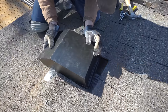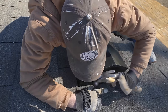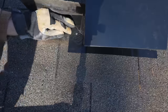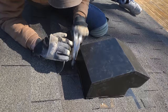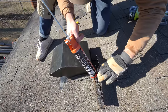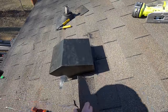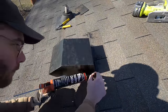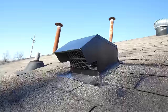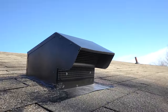I'll be adding roofing sealant after attaching nails around the edge of the flashing under each layer of shingles. The nails go through the flashing and into the roof decking, then the shingles cover up that nail making it all watertight. Under each shingle I disturbed and around the perimeter of the roof vent I apply a liberal amount of roofing cement to make sure everything lays flat, is watertight, and won't have any wind damage over time. The sealant is pretty messy, but make sure you cover any exposed nail heads. And now — that is a roof vent successfully installed.